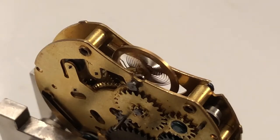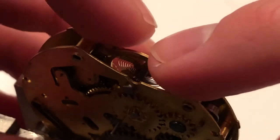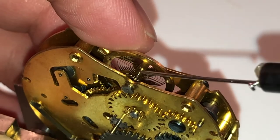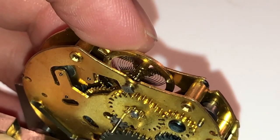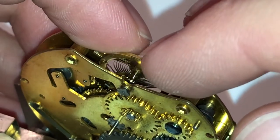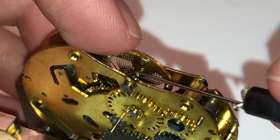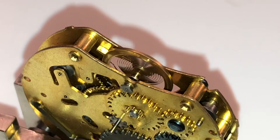That is really decent motion right there. Up next we're going to oil the impulse pin. I hope you can actually see it there better — I'm just going to get that pin there. A little drop of — oh my gosh, of course I oiled the balance wheel. Why wouldn't I oil the balance wheel? Okay, let's try that again. Where's the impulse pin? I've completely lost it. Oh, there it is. It's kind of hard to see, not much though. Okay, we're going to leave it like that — call it our day. We dabbed it with oil, hit the pin.